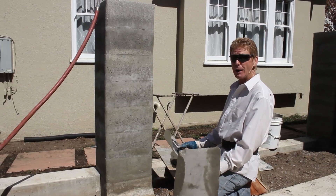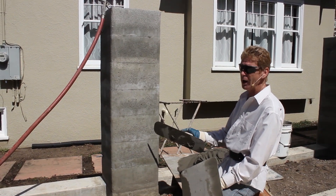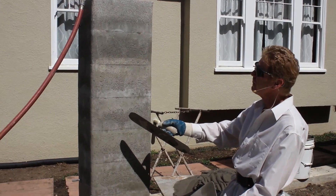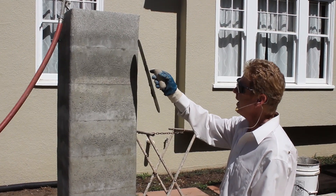Hi guys, Kirk, Jay, and Lou here with Kirk Giordano Plastering. Today we're going to give you some tips on how to skim coat cinder block walls. As soon as I saw this I told the homeowner, 'Whoa, you put a regular Portland cement plaster here without sand, didn't you, for all the joints?' He said yeah, and I said I could tell — it's cracked like an egg everywhere. You're supposed to add some sand.